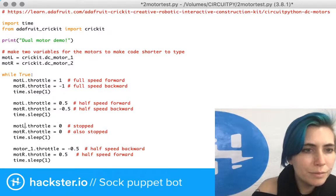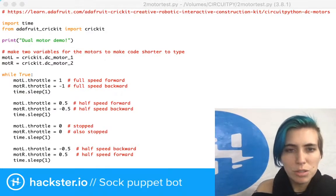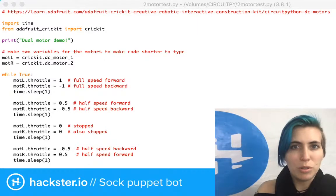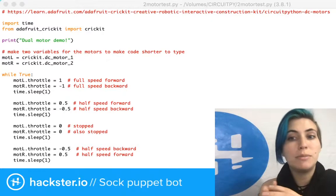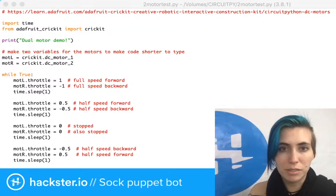So, let's save this. And then I'm browsing to CircuitPy, which shows up as a flash device in my file system, and I'm going to update main.py. I'm gonna redrag this on there, but it's already on there, as you can see. Normally what I will do is edit files on my computer and then drag them onto the external Playground Express, because that's better: you have a backup, you know exactly what it is, and you can edit it separately.